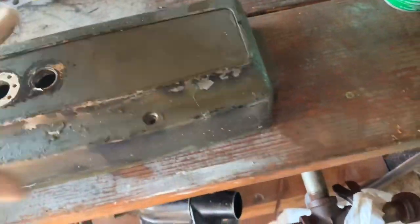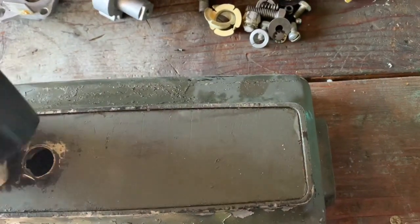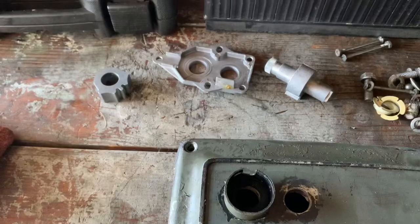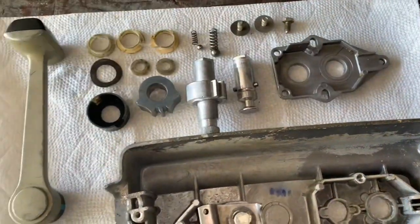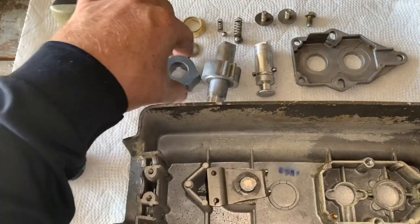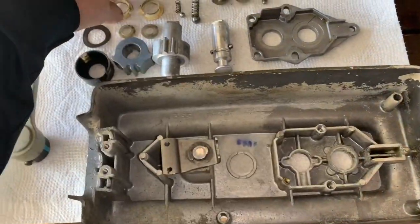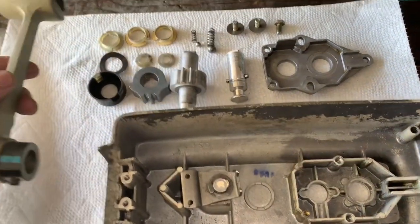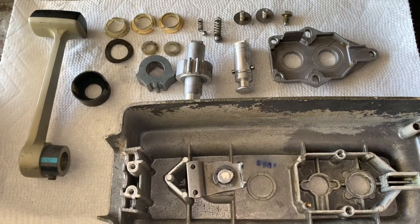This is the front side of the box — the cables come in on this side and the handle goes in here. The orientation has the notch on top so you can read the stickers for neutral, forward, and reverse. Here are all my parts — everything has to go back in. I'll start by installing the two gears. The gear is attached to the shaft, so this gear goes to that gear. I'll install them with the appropriate bushings or bearings, a spring-loaded washer for spring retention, and then the handle with its bushing.